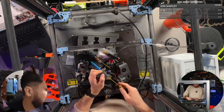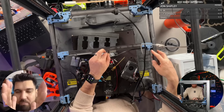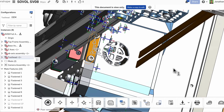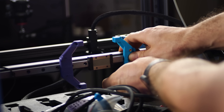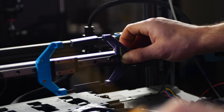First, we realized we didn't have long enough screws for the LGX version of the tool heads and would need to order the exceedingly rare M3 by 50s. No worries — we could still do the BMG versions of the tool heads. Then it was time to try and get the Stealth Changer carriage onto the printer. The original SV08 belts are extremely short because they're held in place by metal fins on the side, but for our setup we need them pulled taut and held behind the carriage itself, like a normal Voron installation. Try as I might, I couldn't get the belts behind the carriage with clamps or pliers, so we printed out a belt helper part to clamp the original SV08 belts and hold them in place while we tried to attach the new Stealth Burner carriage.